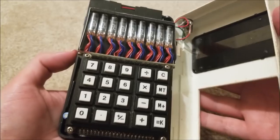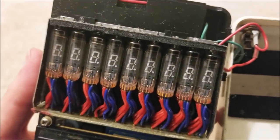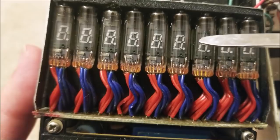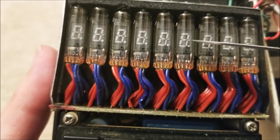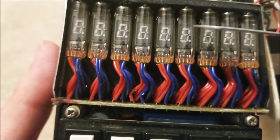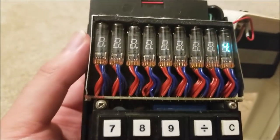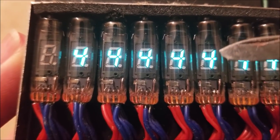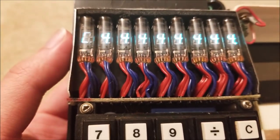You can just get in there, give it a little wiggle, and you can see the tubes now. Wow, those are tiny. Look how cute the evacuation stems on top are — they're so tiny. The individual tubes, we can just focus right on that. You can see they actually have something peculiar: the number 4 has an extra little part — right to the right side of the digit it extends a little bit further out. A normal 7-segment wouldn't have that, and that's actually displayed for the character 4. You can see it glowing, and if we zoom in there's a little tail on the side that's really odd. That's the only digit that does that — just a small peculiarity.